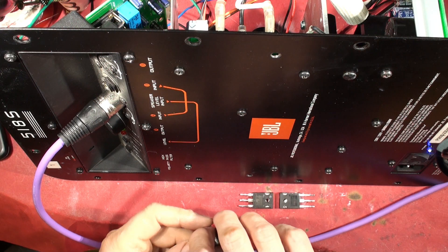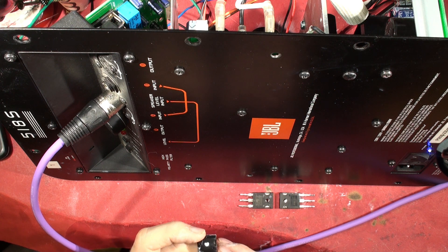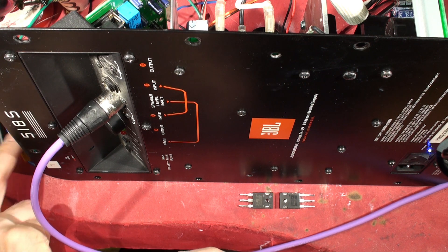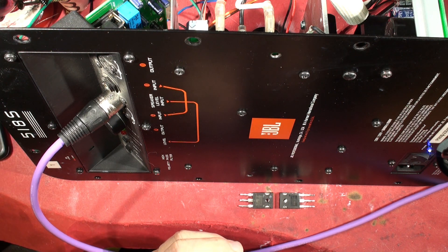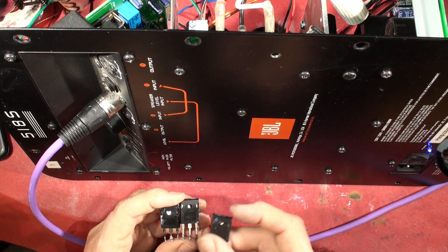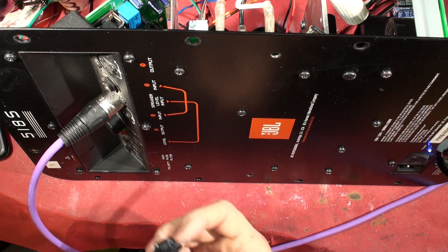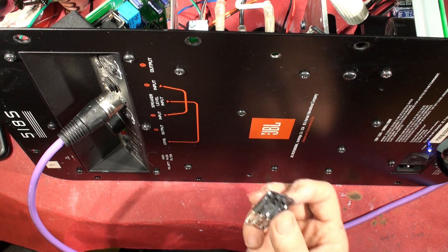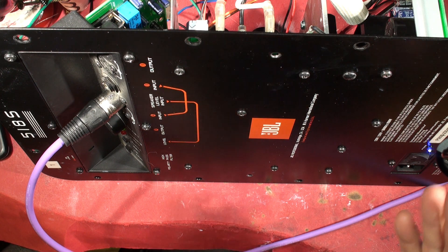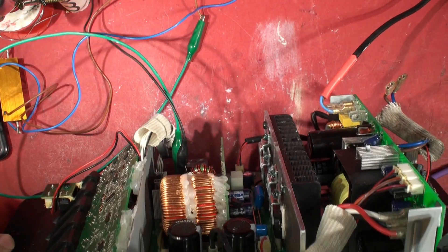It's conclusive. Should you just change one if you only find one faulty transistor? The answer is: I put this back on and ran it for something like three or four minutes at 120 watts until the load got too hot — and it went again, it blew. So I had to take it apart again and change both of them — one I changed again and one is the original. So if you change a pair of transistors, always change both of them, because if one has failed, the other one isn't far behind, even if it's not shorted. I've done that so you don't have to try it. The advice is always change all the output devices. It's working now — it's got a 60 Hz signal going into it, the load's getting very hot, and she's all back together and working.